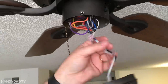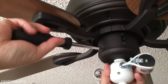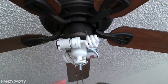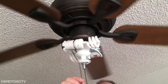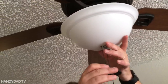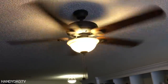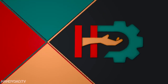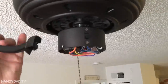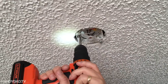The lighting kit connects to the blue and white wires on the fan motor. These CFL bulbs were included with the fan. With the wall switch on, I tested that the light and fan work correctly, then installed the globe and pull chains. The switch controls the fan and the light at the same time. When Julie moves out, I told her to remove the globe, bulbs, and fan blades, then remove the whole motor unit and ceiling bracket, and put back the wire nuts and the blank plate like we found it.